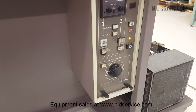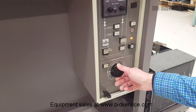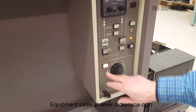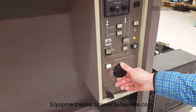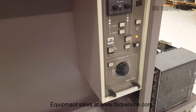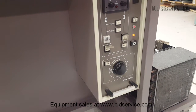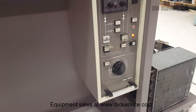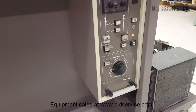I'll shut the circulator down for a minute. Once you start the program, it's going to run all the way through — this takes about 16 hours. What that'll do is it'll regenerate your filter media there — your molecular sieve and copper pellets. It'll regenerate and allow you to have a fresh bed inside your purifier.